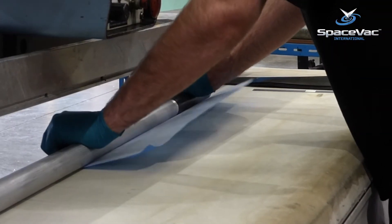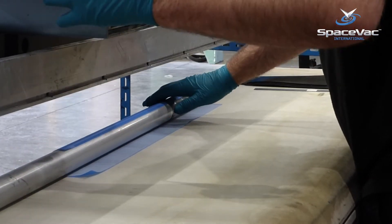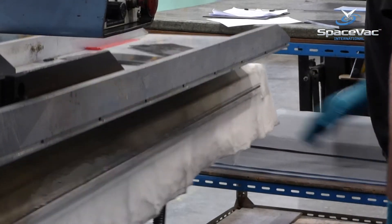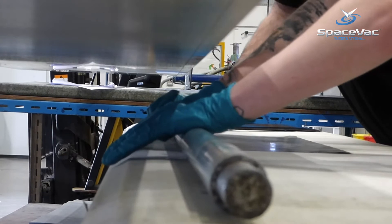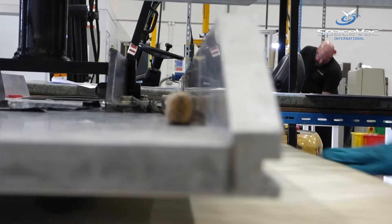These carbon sheets are now applied to a central mandrel to create the perfect tubular structure. The sheet is first aligned by hand and then rolled firmly into place using an industrial press, ensuring a smooth, even application of the material along the entire length of the pole. This process is then repeated until the pole has reached the required thickness.